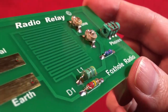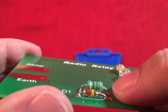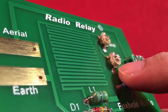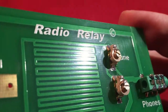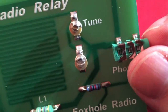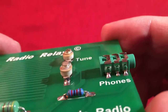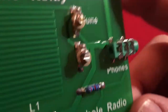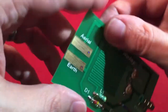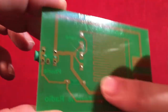Tried to get my joints clean. The pads are very easy to solder. The tricky one was the inductor — getting that placed well in there because you can see how tight the fit is. The diode was easy, the resistor was easy. The variable capacitors were really easy — they had little tabs that you could bend on the bottom to hold them in place. The headphone jack I was a little nervous with because it's plastic or nylon — I was worried about getting it too hot and melting it, so I was trying to be really quick. On the back side you can see I trimmed off all the leads because it's soldered from the front not from the back.